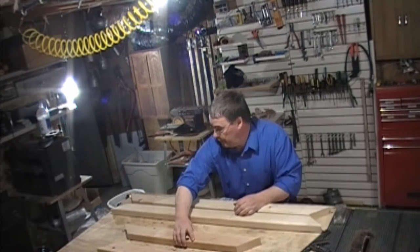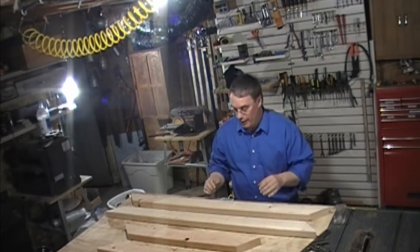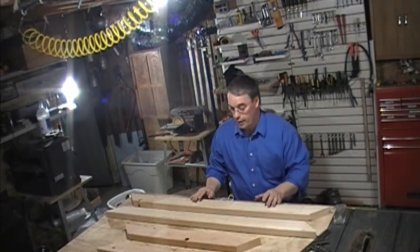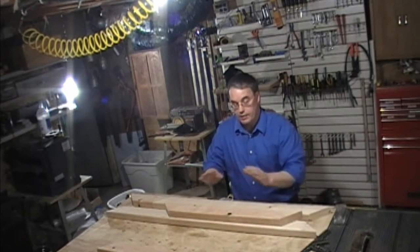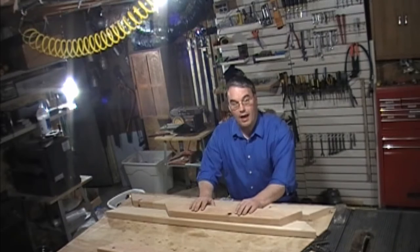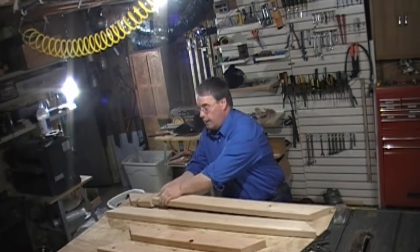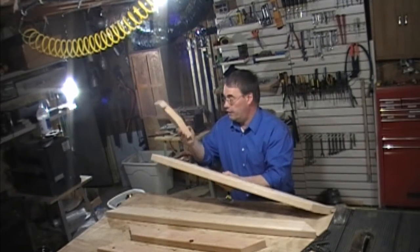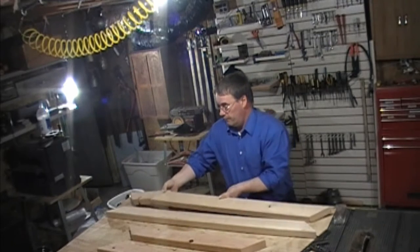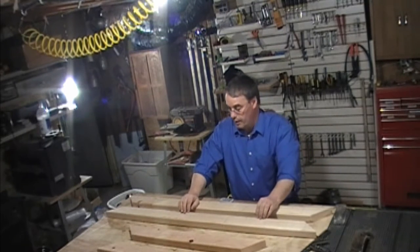We've got our cuts — top piece, bottom piece, and one of the sides. Something important: you want to measure it out well and plan your cuts carefully. The best way would have been to cut one top piece and one side piece at a time. Instead I cut both tops first and wound up with a little less than I needed. So I did a lap joint — cut two pieces at an angle and brought them together. We'll put screws and glue in there. Then we'll route out these edges so the Fresnel lens can sit into them, and put a little strip around to hold it in place.